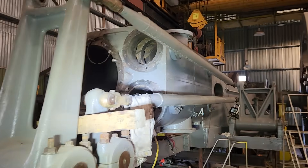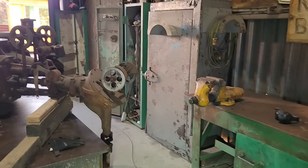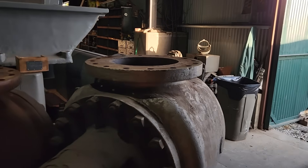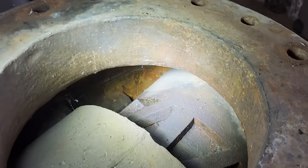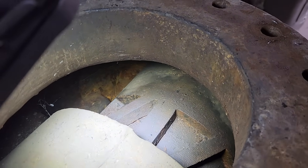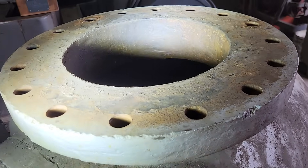In order to get in there tomorrow — basically poke your head down through the top to adjust that center bearing — we had to take the throttle valves off. So since we got the throttle valves off, we'll come over here and take a look at them. This one here on the right is the main throttle valve, made by the William Todd Company. It looks very similar to the piston valves on the inside — there is the cage and then there is a spool that fits inside. When you open the valve, it just opens up that surface a little at a time and lets more steam into the valve chest.